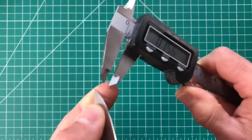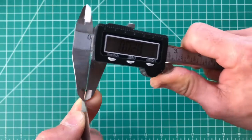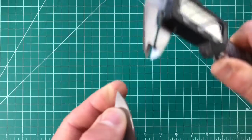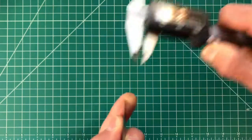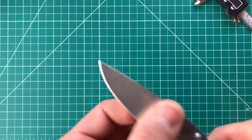So it's about a 35 inclusive angle. So it does thicken up a little bit. There's 23 right there by the tip. So, yeah. Really nice grind, guys, and I did notice 25 right at the very tip. I did notice in use how well this thing sliced.